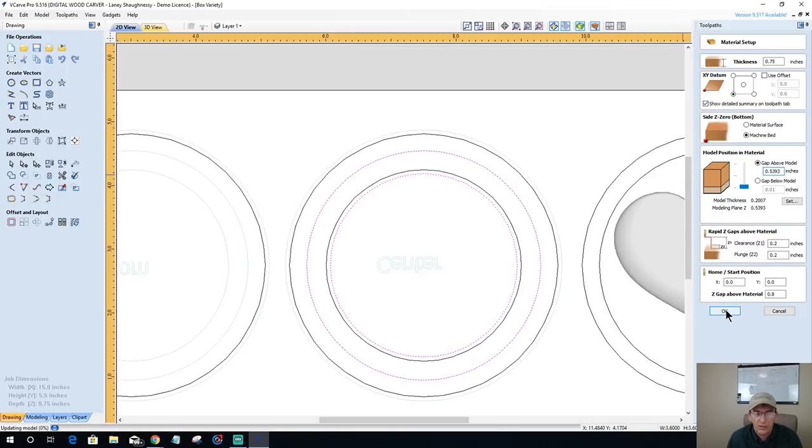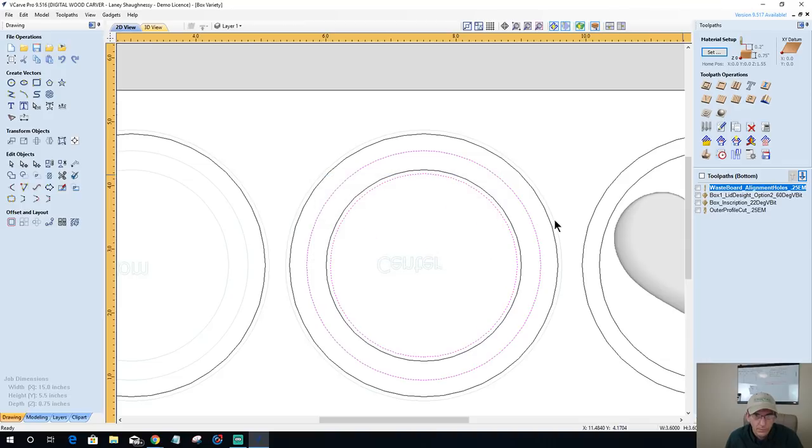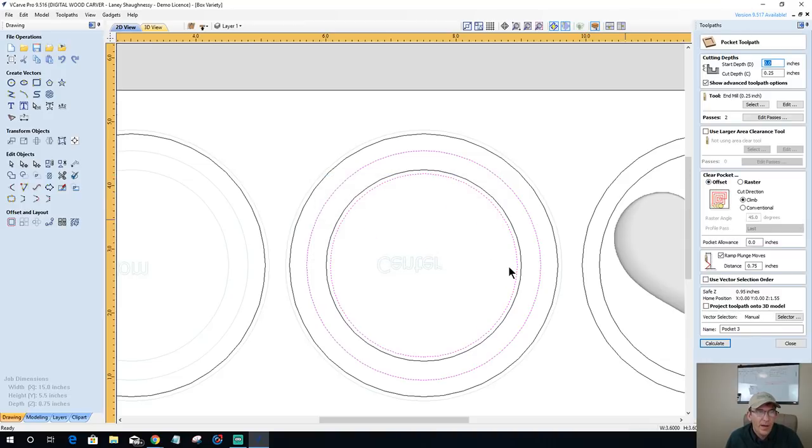All right. So let's click OK. Let's get back to what we were doing. Yeah, because you brought the model in, it wanted you to verify the material setup. So we had to do that. Okay, so on my pocket cut, this is going to be cut to 0.27, just a little bit. I want a little bit of room for glue, but I don't want a big old air gap. The 0.27,